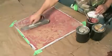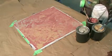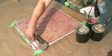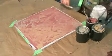If you pull the trowel hard, more blending of the colors will occur. If you pull softly, only the high spots will level out and create a beautiful natural looking texture. This finish is nicknamed Mediterranean stucco for its ability to render natural looking walls from the warm European countries.